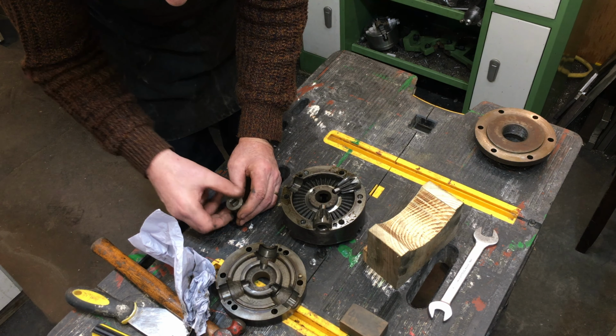Now to sort out the back plate. The spindle nose adapter face has to be parallel to the adapter spigot face. And because I couldn't guarantee to get the spigot face true on a lathe, I chose to grind the nose adapter face. The joint face has a spigot protruding beyond the joint face itself, so I used three parallels to remove that issue. But magnetism won't pass through these parallels beyond a slight attraction, so I put two V-blocks at each end to stop it sliding along the magnetic chuck.